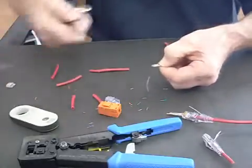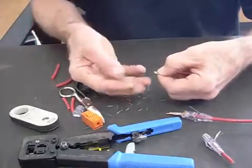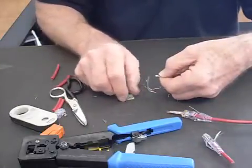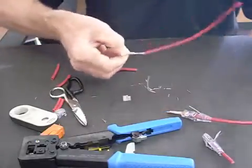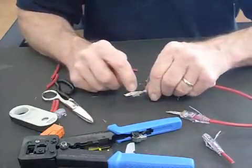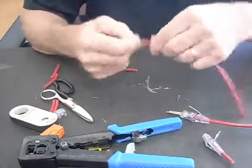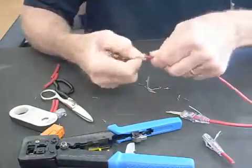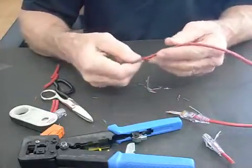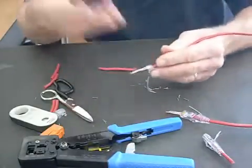Trim the wires. We have the wire guide bar — a little piece with the color chart on it. It's reversed from what a connector would be, so flip it and slide the wires in. It's perforated on top so it can take contacts. See the wires coming through just like on an Easy RJ45. Pull it and stretch it so that the twists are up right at the point of termination — very high performance. That's how it looks for the prep.